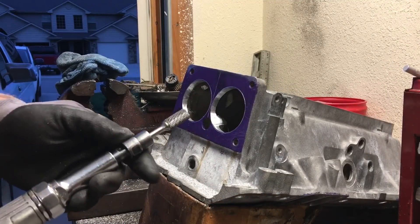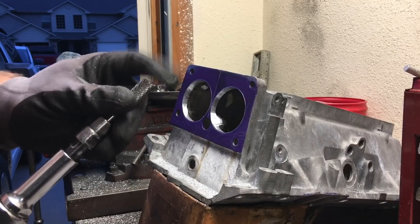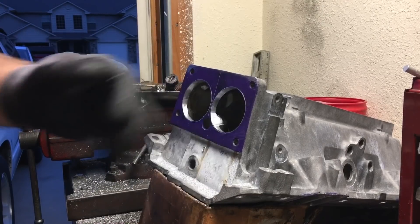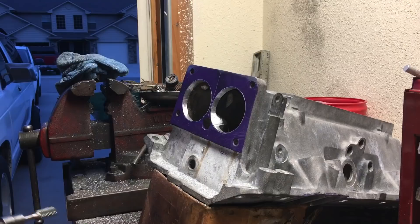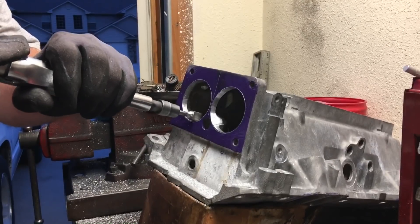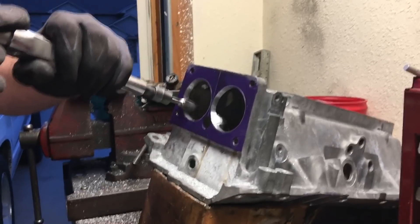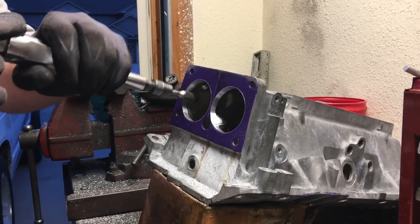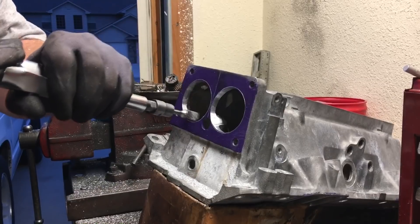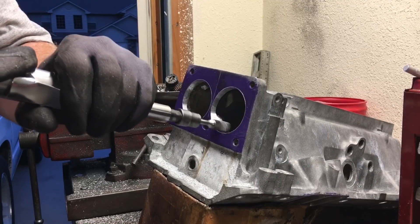All I'm showing you now is that this double-cut burr with the flat sides — be careful because this is a square cutter, flat cut on the tip, so don't reach in and grab onto anything you don't mean to cut. What this does is give you a flat surface to clean up your bore. You'll move this tool all the way around, flattening and crisping up the cut all the way around. It's going to give it a better end result because you've got the right tool to get the job done.